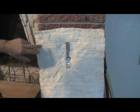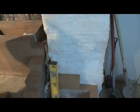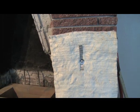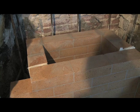This is an insulative and an expansion joint, because this gets really hot, it's got to be able to move different temperatures than the outside veneer. It's high temperature, it's about 2700 degrees. You can use a variety of other things, we prefer the really good quality.